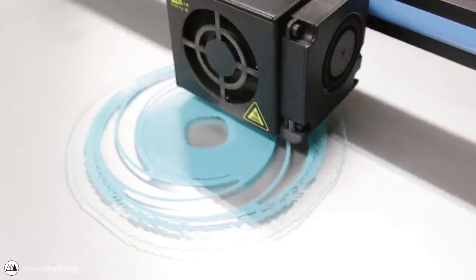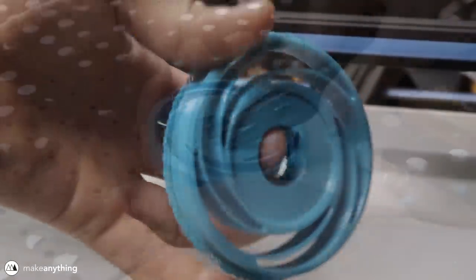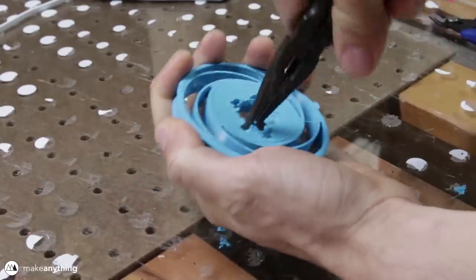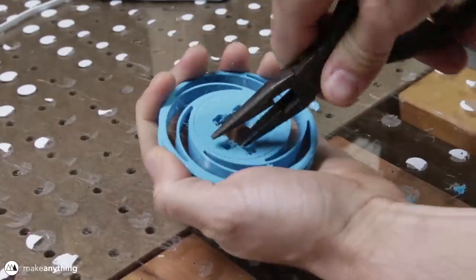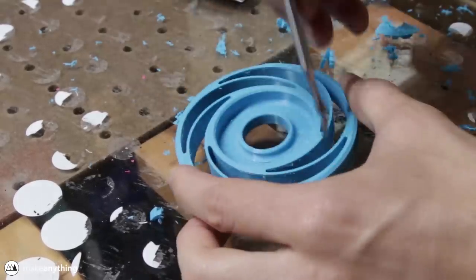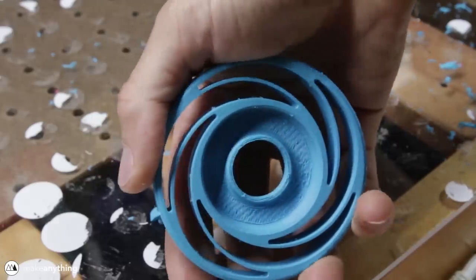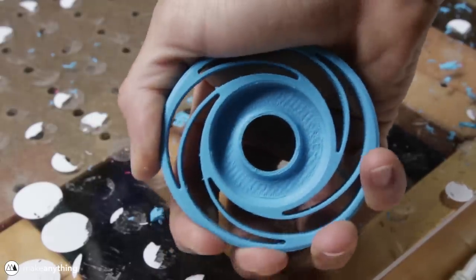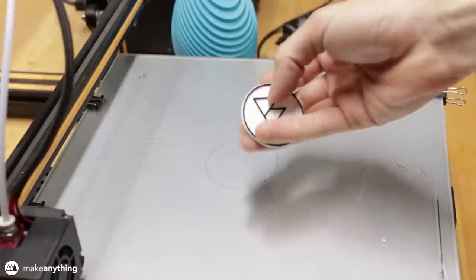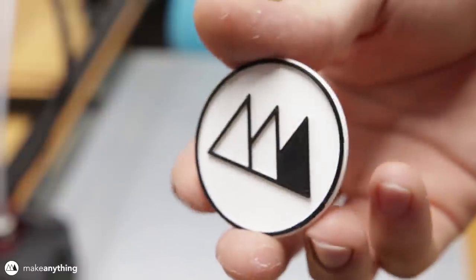Here's the main body printing out on my CR10 in this lovely Pro PLA from Matterhackers — this is one of my favorite blues. This piece did require some support material, so I'm going to pry that all out and reveal that hollow section in the back, which is going to hold the weight. Here you can see the springiness built into the part. I printed the logo using a color swap and a 0.2mm nozzle so those triangles are nice and sharp and everything looks really clean.